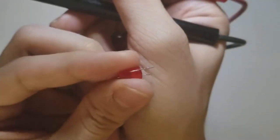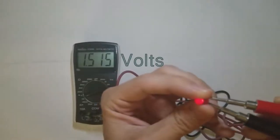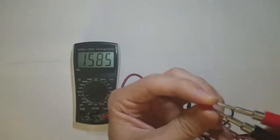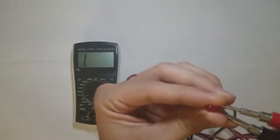Here's a simple red LED. The positive lead is the long lead. We're going to test it by applying the red probe to the long lead. Notice that it takes about 1.5 volts to power the LED. And when we try to power it backwards, it doesn't activate. That's because diodes and LEDs are directional.